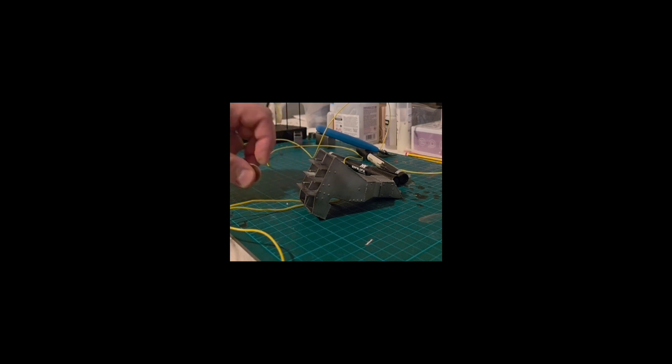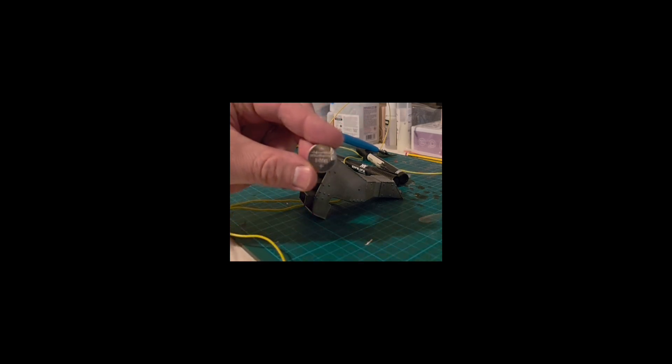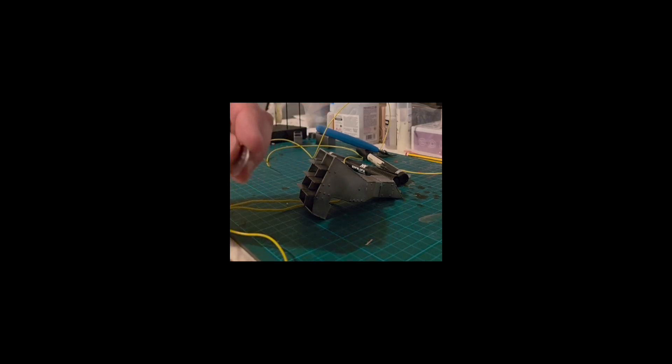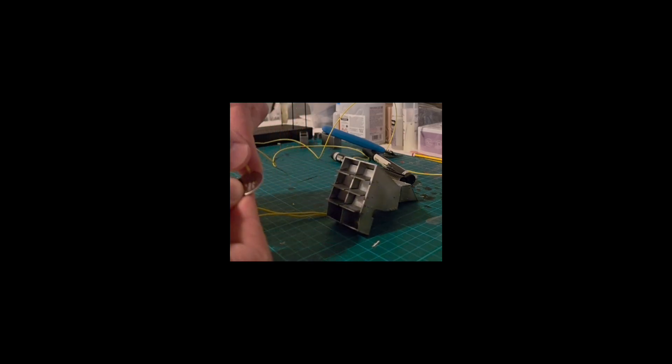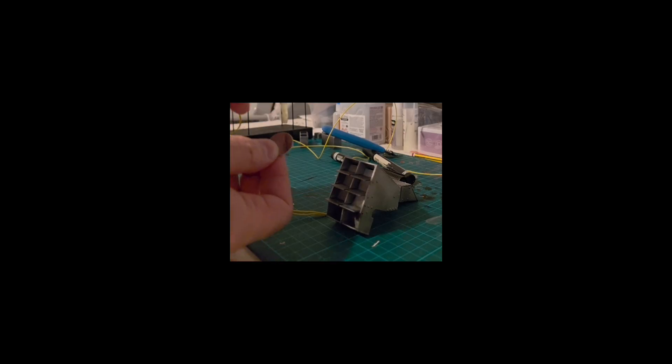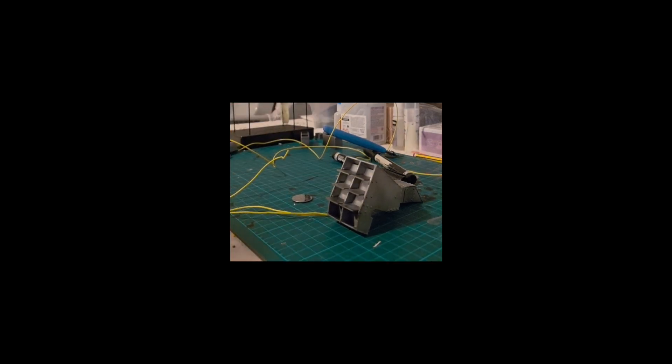As with all the components that have lights, once I've finished the wiring, I always like to test that the lighting still works because I don't want to get to the end of the project and find that some lights don't work. I do this with a simple three-volt watch battery — put the wires on positive and negative. Do make sure you have them the right way around or they won't work. It's a good way to start marking up your wiring, which one's positive and which one's negative.